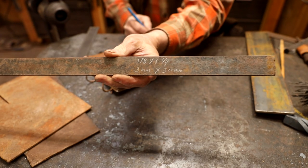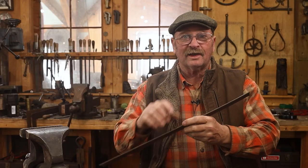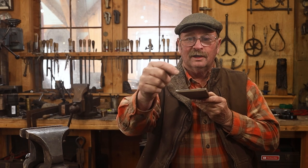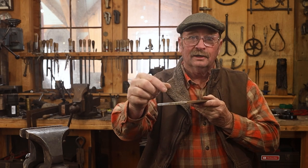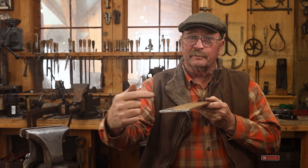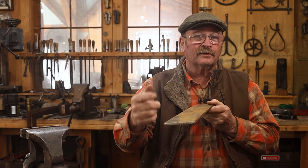The hinge on the back I'm going to start with a piece of one-and-a-quarter inch material — this looks like it's about 30 millimeters wide, eighth-inch thick, so about three millimeters thick. This has to have an eye on both ends, and those eyes have to come out exact on the end of this bar. If they're too long or too short the hinges aren't going to work properly. Too short's not bad — I can draw it out a little bit in the middle. Too long it's going to be really hard to upset this thin strap material. So the first thing to do is figure out how much material I need.